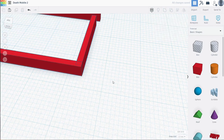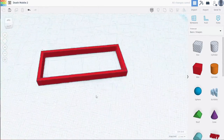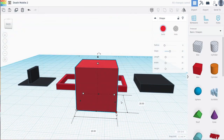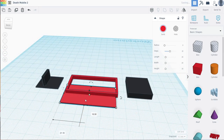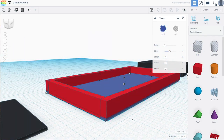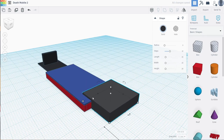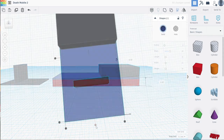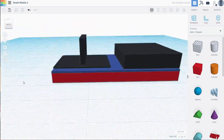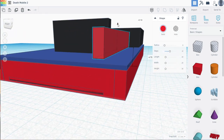I join the 48-inch pieces with two more cut to 21 inches, giving us a total width of a 24 by 48-inch square, and then add the plywood sheet on top. I made a mock-up of my seat, pedals, and later my steering wheel to help with visuals and to double-check measurements before cutting any wood. I then added a couple more 2x4s to lift the pedals up in the air a bit.